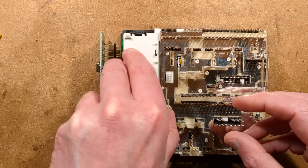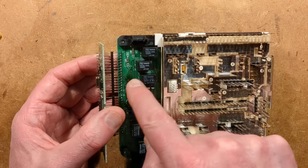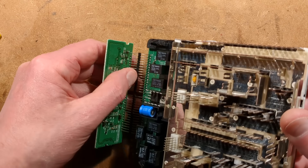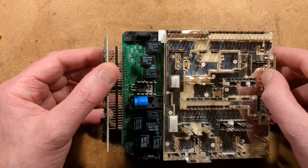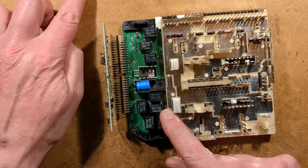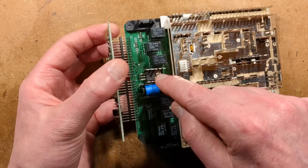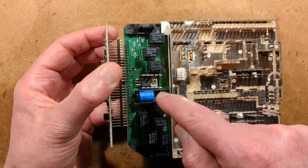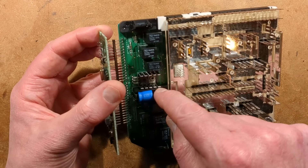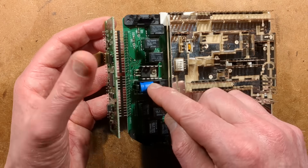Incidentally, they were hidden under a little plastic cover like this. I'm not convinced that I can see these relays have diodes across the coils, and they don't all seem to be controlled from this board - it looks as though there may be external input for that. These ones don't even have visible diodes. Down here is a voltage regulator - I think it's a 5-volt regulator - with a little smoothing capacitor and a little housing next to it, which keeps it away thermally and physically supports it, mounted well up off the board.